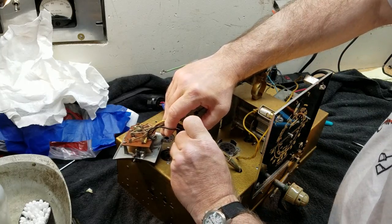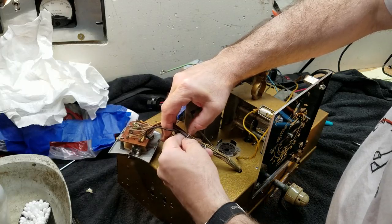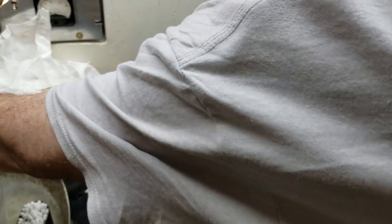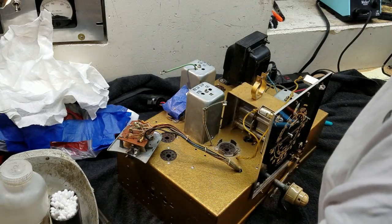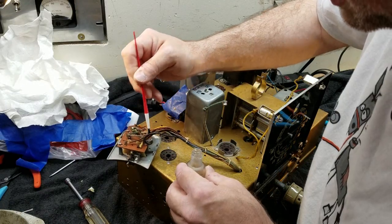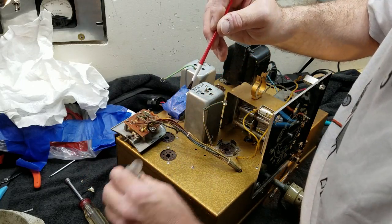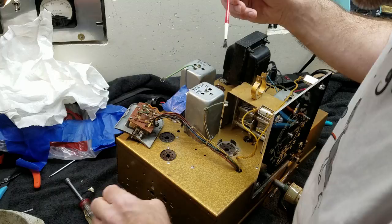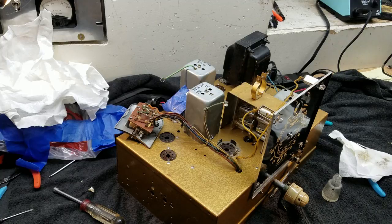This is wanting to come a little loose, so just tighten it a bit. Now's the time for my good buddy lacquer. You'll see this black wire's already got lacquer coating on it, and sometimes I will re-lacquer them, because that original lacquer after 70 years has kind of cracked. I'll let that sit for about 20 minutes and it'll be just fine. That will really liven up those colors when it's dry.